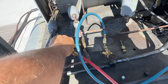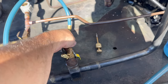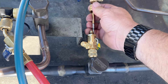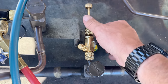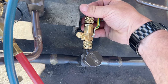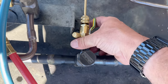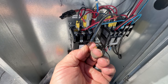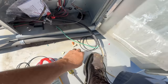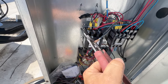Hopefully the sight glass starts to turn green. Don't put the Schrader core in before you get the system to a positive pressure, because you will suck crap right into it when you're trying to put it in. I've got newbies and pros watching — sometimes I've got to mention the obvious because you never know who's watching. Been using the new Appions — they are a little nicer. I hate switching over until I get these wore out, but they still work fairly decent.